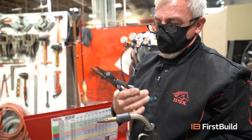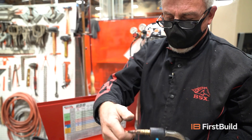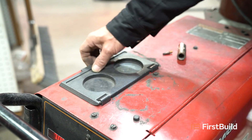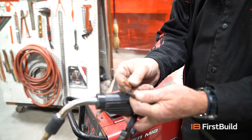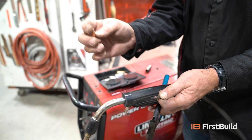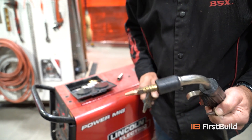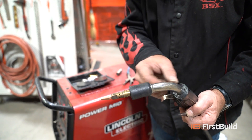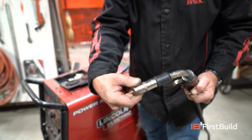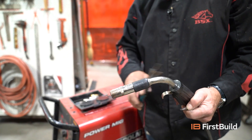There are two more things MIG pliers will do for you. Sometimes the tip is very hot or torqued in hard — we use the MIG pliers to twist the tip loose so you can put a new one on. Since we're going to learn to weld today, let's start with a new tip. This Lincoln does a nice job of storing consumables in a little tray on top. Here's what an older tip looks like versus a new one — the wire passes through that little hole and gets its conductance there to create the weld joint. We feed that back over the end and tighten it into the gun. This is also where the gas comes out — traveling down the inside of the torch through these holes, creating the shielding. The MIG pliers can also remove the nozzle if needed.